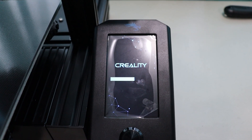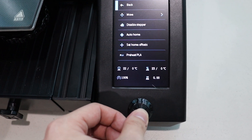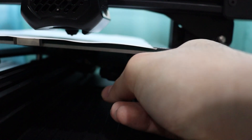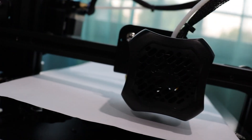The next most important step — and the one that took most of my time and test filament — is fixing your bed. Press Prepare, go to Auto Home so you can see the default position. Once the extruder almost touches the bed, press Disable Stepper so you can adjust freely. To adjust the bed, use the knobs at the bottom and twist them. You need your nozzle to be about one A4 paper's distance away from each of the corners, or you're going to have a really bad time. Keep adjusting and take your time.